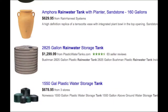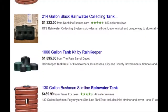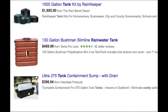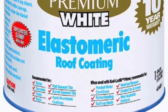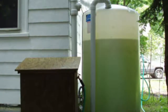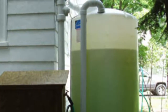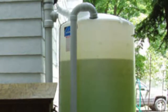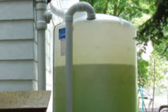Tank prices can range from around 50 cents to about a dollar per gallon of storage capacity. Regardless of which color and weight you choose, it is recommended that the tanks be painted with a material that will bond to the surface and keep sunlight out. This is because even the black tanks actually transmit enough light to allow algae to grow in the water inside. This painting is critically important in drinking water systems unless the tanks are located in an area which receives absolutely no sunlight, such as under a solid deck.